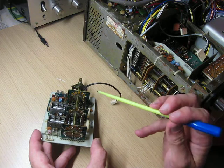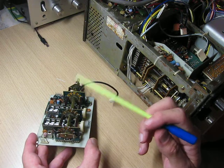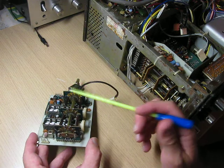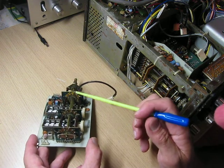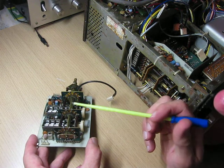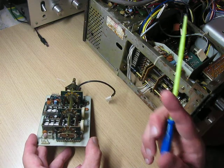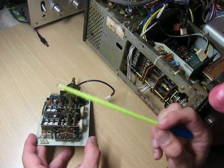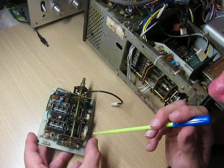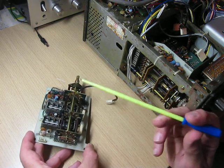So these two parts of the switches aren't doing anything at all — this part's okay, the two wiping contacts there are fine, so that's working all right. This is the RF preamp and it's also the beginning, the first mixing stage, so it feeds into the IF stage after this. The output to the IF stage is fine for that wafer, but certainly the RF preamp isn't doing anything except on 80 metres. That tuned circuit and bridge mean it was working on 80 metres but not really working at all on the other bands. Of course the transmitter will work on the other bands because it's got nothing to do with this board, but the receiver won't.